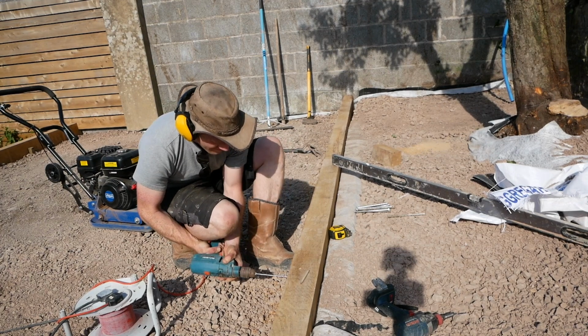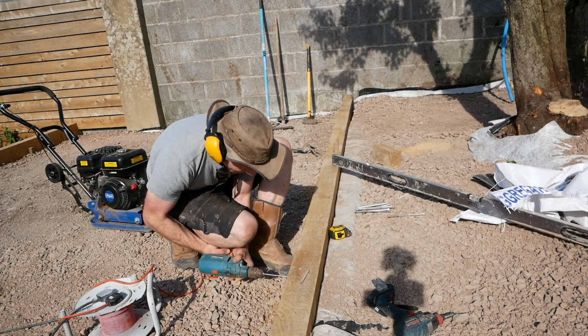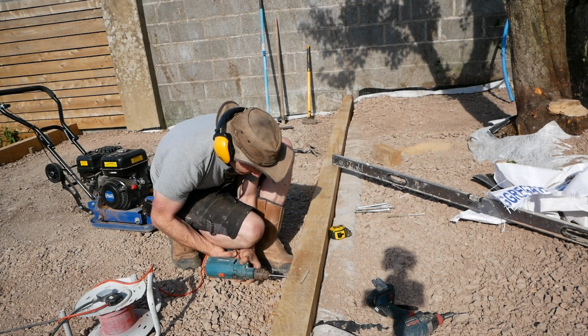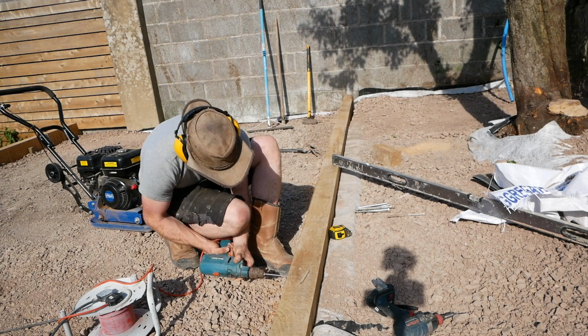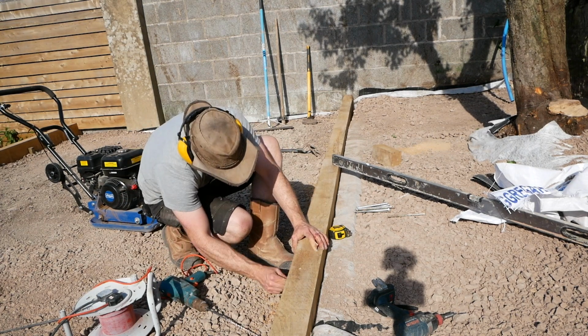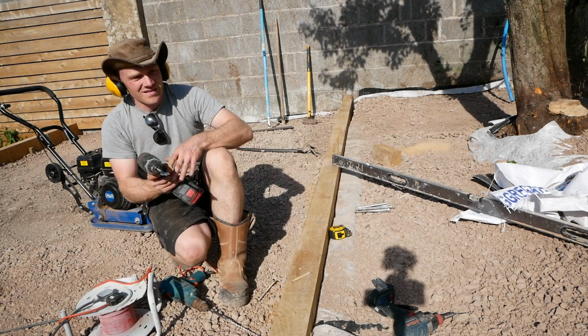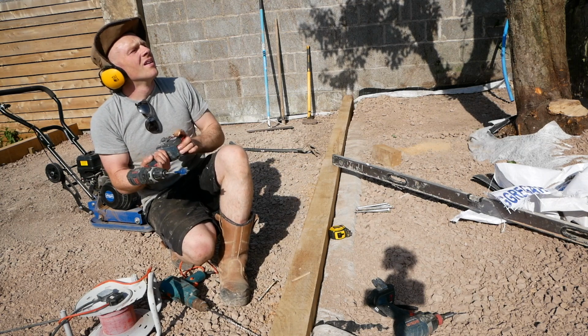So we've ended up with about 100mm on average of this Type 1 sub-base, which is a dust to 50mm mix. Everywhere sells it under a different name or a different colour, but essentially it's a fairly standardised type thing which self-binds together. You're going to need to do at least 100mm for a patio or a path, ideally more, but remember to just keep compacting it in layers.